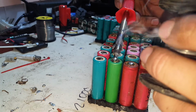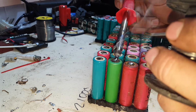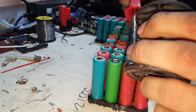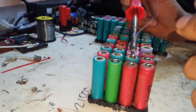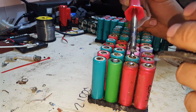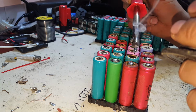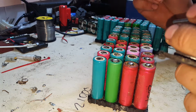If you go and clean up a bunch of really rusty ones, you'd probably want to either give the wire wheel a bit of a blow off and a clean up or something, I don't know, but you don't want to go and stick too many iron filings or iron oxide rust particles in with your fresh work, so it'll make a mess. Is that one still not sticking? See the balls? Really fluid.